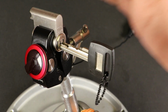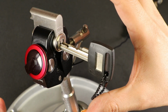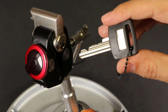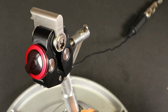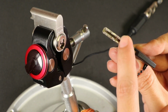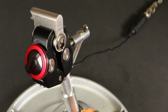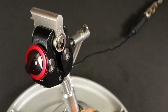There's a little bit of security pinning in the top, in that there's some of them that you have to set twice. And on the key pins, there are some that you could overset. So the pins are staggered. This one's closer than that pin and down, so that if you pick it, you don't have to worry about the right side drivers dropping to the left side chambers or anything like that.